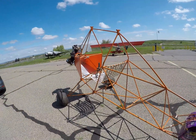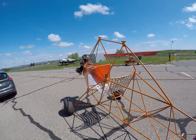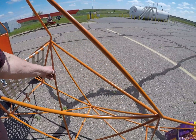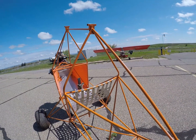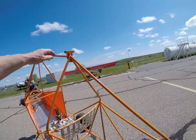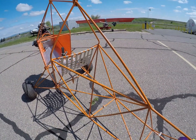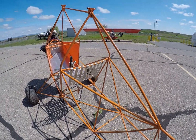I'm going to add on to my video — I meant to mention this earlier. One of the things I've done is add this diagonal right here. Before I added that diagonal, with the fuselage bottom tied firmly down on my workbench, if you grabbed the top it would wiggle. With all this light wall tubing that's aggravated more than with 0.035. I put that brace across there — that diagonal — and it doesn't wiggle anymore. It moves as an assembly.